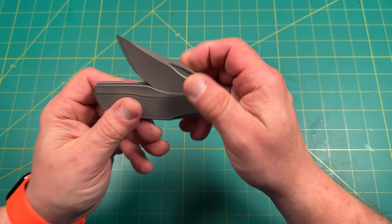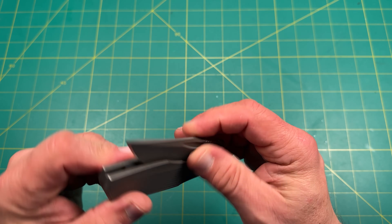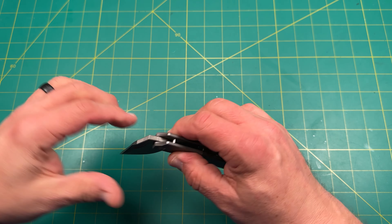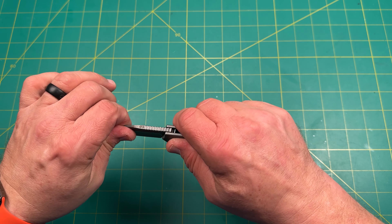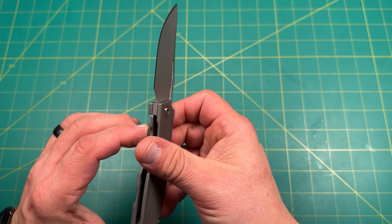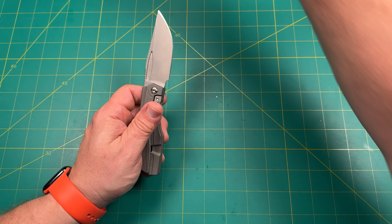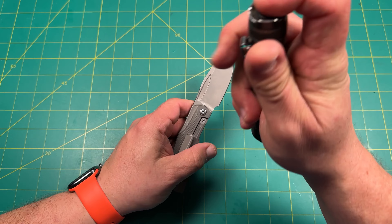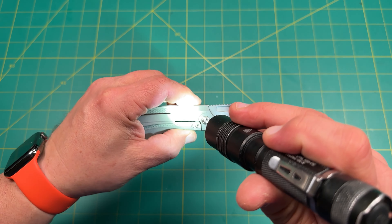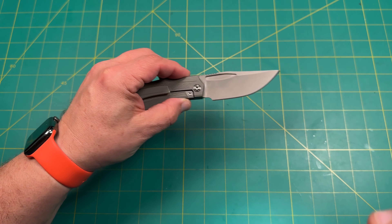All right, we're nice and dead center. Let's listen to that detent — nice and clickety for sure. Any detent lash? No. Maybe pivot play? No. Blade rock? No, it's in there really solid. Got a steel bar insert. Over-travel stop — is that an over-travel stop in there? Yeah, there's an over-travel stop right in there. You see that right there? That's nice, very cool.